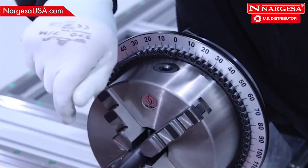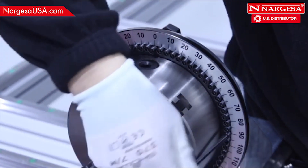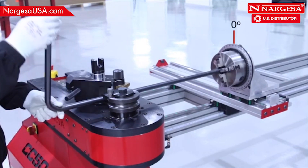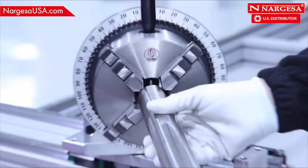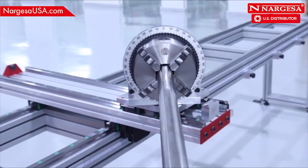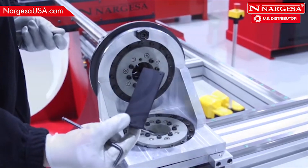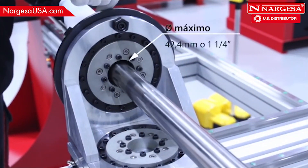To adjust the rotation angle, the tray can be positioned every five degrees. For a 30-degree or 90-degree slope, simply release the corresponding bolts. The rotating tray has an inner limit which marks the end point the pipe can reach. If you need to bend a longer piece, you can remove this inner limit to get a pass-through tray, for a diameter of up to 42.4 millimeters (one and a quarter inch) maximum.